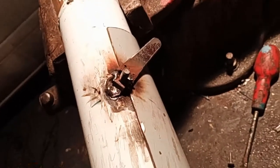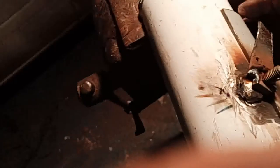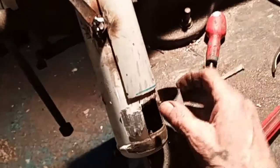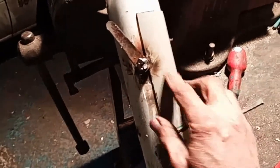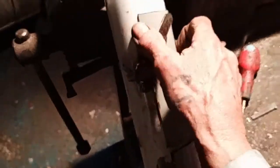So here we go - we need a little catch. I've made a catch on there now which opens up. It's red hot still. Opens up and a little door opens. When you shut it, lock it down and the door is shut. So there's the fire - there's the ash emptier, you open that to empty the ash. And this is the one you open to put coal in - you open that, it opens up, you fill your coal in before it's lit, chuck it in, shut that, pull that over, and it's shut. It's that simple.